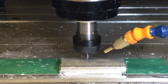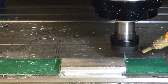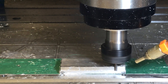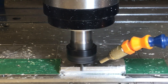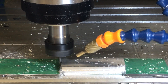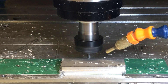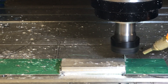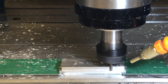So now it's cutting and making some nice chips. They're not angry or anything — they seem pretty happy flying away from the piece. The depth of cut is 5mm but the width of cut is 20% of the cutter, so on a 4mm cutter that would be 0.8mm. Not too stressful. I could have gone full depth which is 9.38mm but I didn't — I just baby it round. There's no need to rush these things when you're just having fun. That cutter lasts a lot longer if I don't push it and don't snap it.